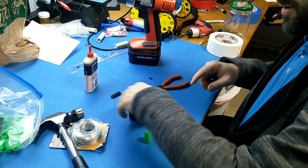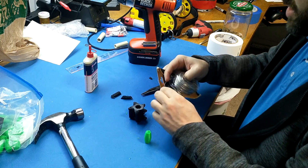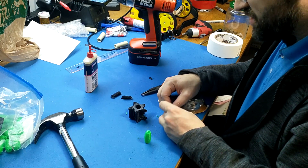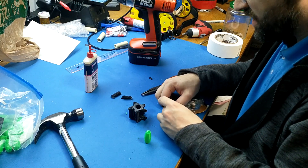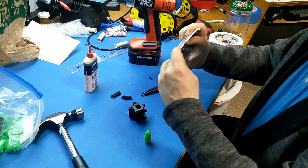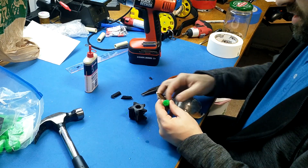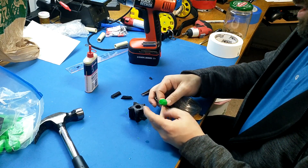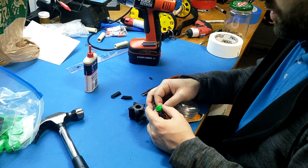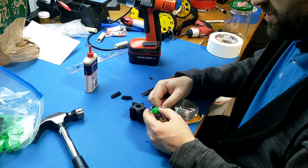Now it's time to install the roller. I've got our 18 gauge steel wire here — this is from a normal hardware store, it's cheap stuff. The key thing: you gotta get this wire as straight as you can, so don't put any kind of tight kinks on there. Look at it side on in both dimensions and do a test fit of your roller onto your wire. If it doesn't free spin you're gonna have a bad time. If it doesn't free spin it either means there's a bend in your wire or when you were reaming it out you left some plastic chunk in there, so hit it with the drill a few more times in that case.